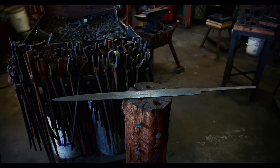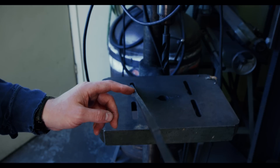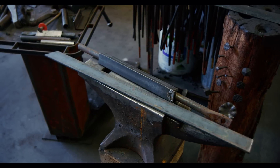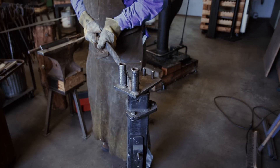It is not unusual for a sword to develop a bend after heat treating. Take a look at my latest sax here. Correcting these bends often requires being able to apply pressure from three points. To accomplish that I will make a simple jig from some angle iron, a flat and a round bar.